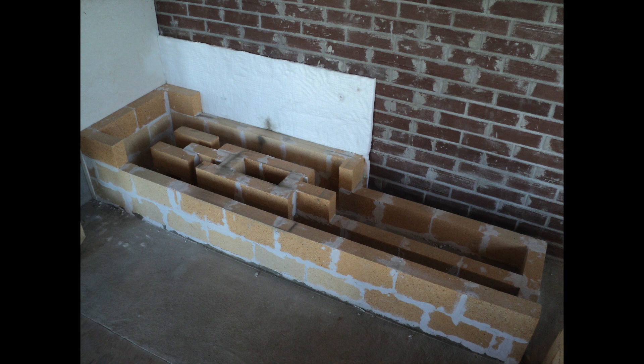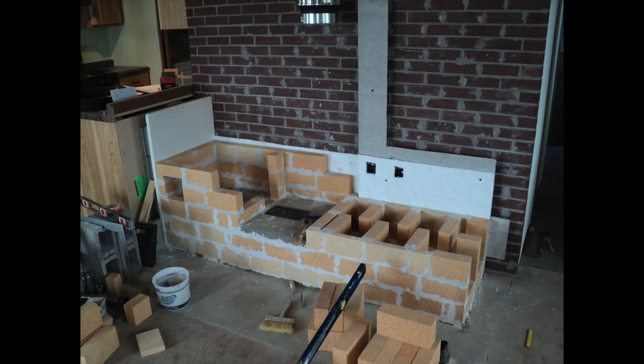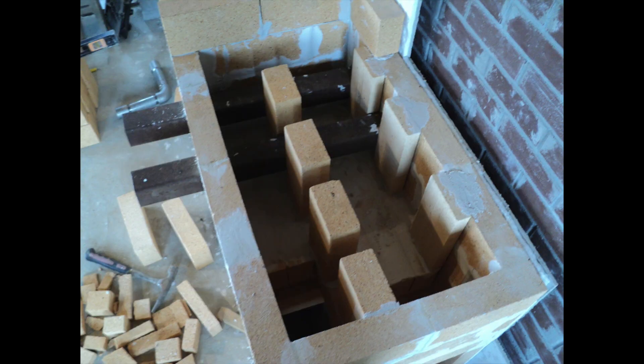The fire brick would be used as a high temperature thermal mass. In this picture you can see how the smoke channels run along the bottom. Then I continued building the fire brick core. I poured the subfloor of the firebox with inch and a half refractory cement and continued insulating as I built higher. To the left of the firebox is where the riser tube would go and to the right more smoke channels.